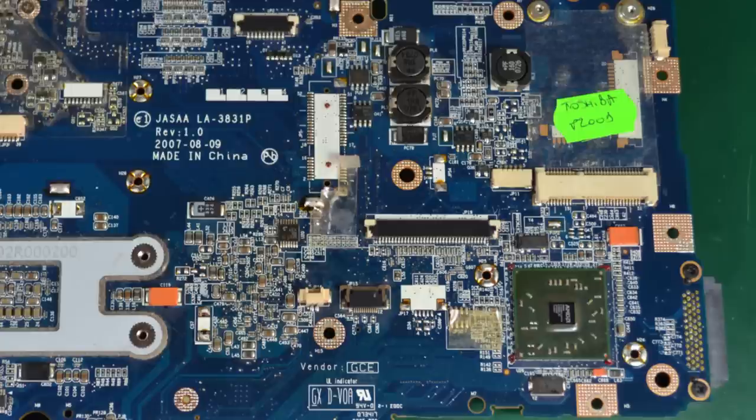And finally on this corner of the PCB we also have inductors, MOSFETs, JST connectors, tantalum capacitors and some crystal oscillators. I'm not going to salvage small ceramic capacitors because I would have to measure them to know their value and that would take too much time, and also they are very inexpensive to buy new. I'm also not salvaging any of the high pin density ICs because they have quite special purposes and they are usually of no use in hobby projects.